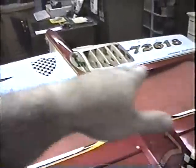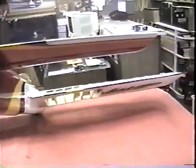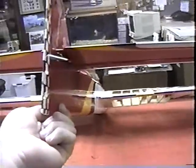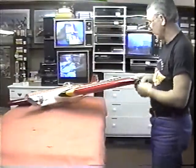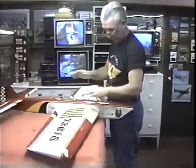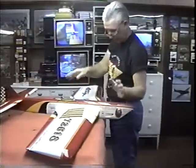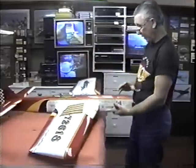And I want to start sanding off all these edges and things. I usually like to let it sit overnight and get another look at if this looks even half even. Well, I guess we're going to know as soon as we fly the plane. Now one thing I would definitely suggest anytime you're going to do this kind of a repair is you get to this point where everything is, I just call it roughed in. We're going to replace a lot of this wood. I just have 2x4s holding things together just to get to this point.